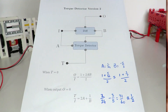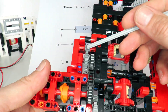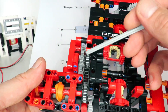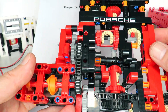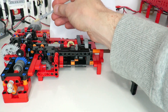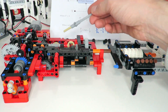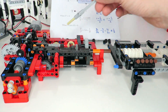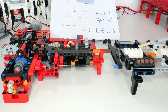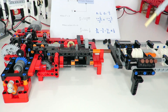With b = −5/3 being about the best value achievable, to increase the output torque of the torque detector I simply added another one-to-three gearing ratio at the bottom in order to drive the gear selector with more torque and power, using a small chain to bridge the gap. The gearbox is now set up for testing: the large Power Functions motor at the back drives the gear selection section, and through the main axle that goes into the torque detection mechanism in the middle. The summing differential feeds the output, which is connected to a torque creation mechanism.